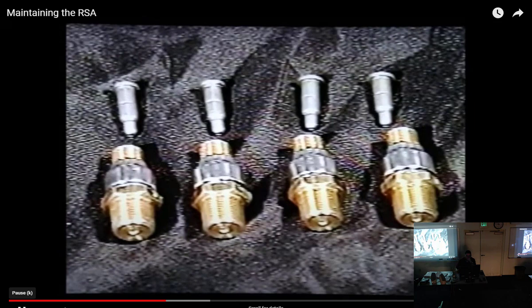You got that? This is a married pair. And that's a matched pair. So if you put all of the bottom ones in one cup and all the top in the other cup, then you have to replace them all. Also, never use wire to clean each nozzle assembly.